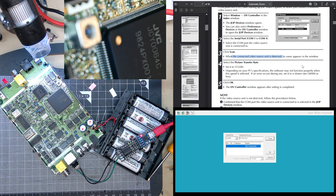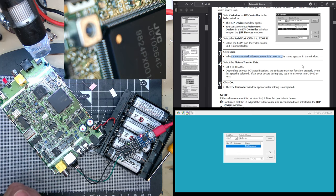So that's the end of this session. It's just a little one. But you saw here a method which is quite interesting if you have a serial port and no idea what the pinout is, especially from this era where they just made up random pinouts for different devices, probably to make them incompatible with each other, so you only bought their products. If it's an RS-232 interface, you can just find the RS-232 chip, find the datasheet, and use a multimeter between the chip and the connector to find the pinout. I'll do another update on this later when I've got the cable.